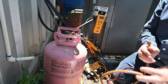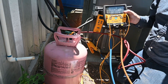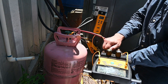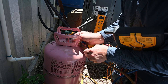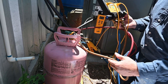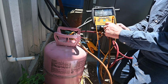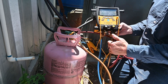I'm going to get my third hose ready, put it over here where it says REF refrigerant. Since I have the valve, I'll take the cap off, make sure it has the rubber O-ring, and put it on my manifold gauge set. I'll put this on top of my gauge and leave the connection a little bit loose. What's in this hose right now is dirty, polluted air, and what's in my manifold is also polluted air. I'm going to open my refrigeration valve that connects this hose to the center, then crack it open and purge this line.